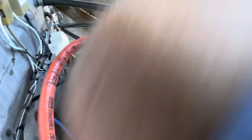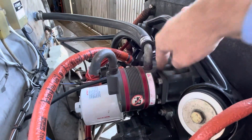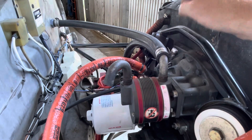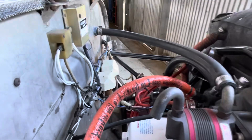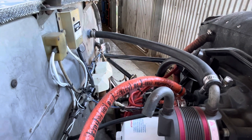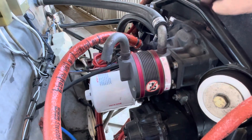The VAC pump is that fella there and it'll be removed and blanked off in an engineering order to say that we've removed it in accordance with some instructions. What will also go is this hose that goes in there to our suction gauge, our DI, and our AH — a little bit of weight saving and something less to service down the track.